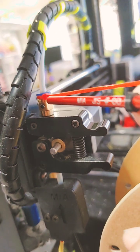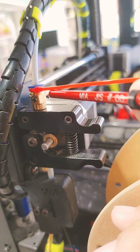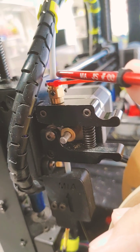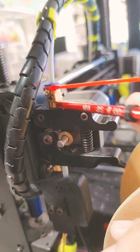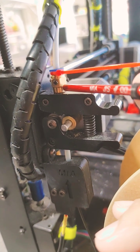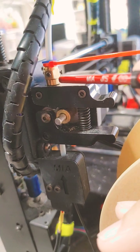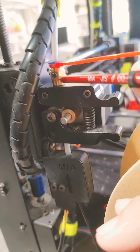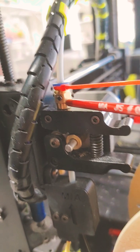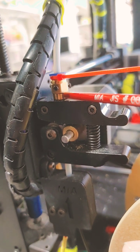The brass part is good. The innards — the clip that retains these things — some are metal, which are the better ones. I have bought some from McMaster-Carr for other applications for injection molding machines that really hold the tube in place. But those are much larger, American standard size. These are metric size, but the innards of these threaded couplers are really crappy because they give out.